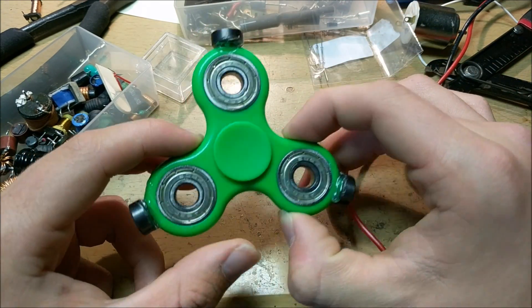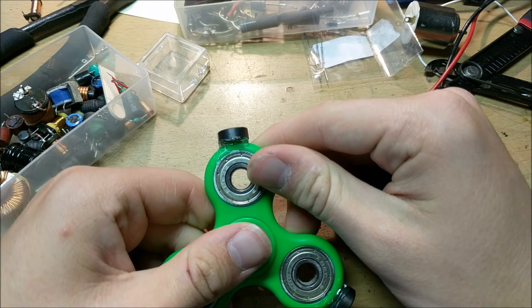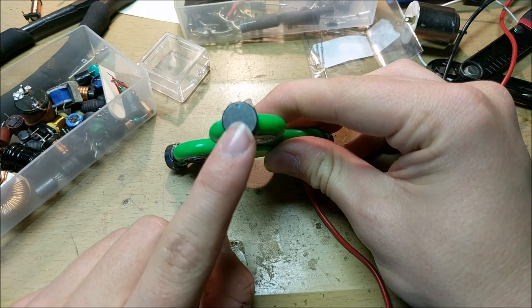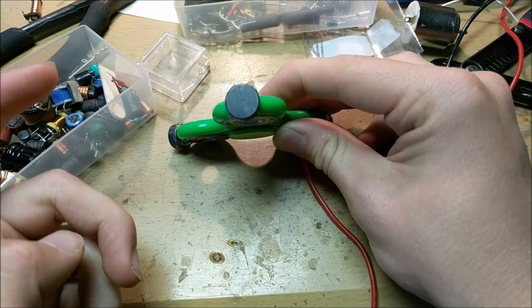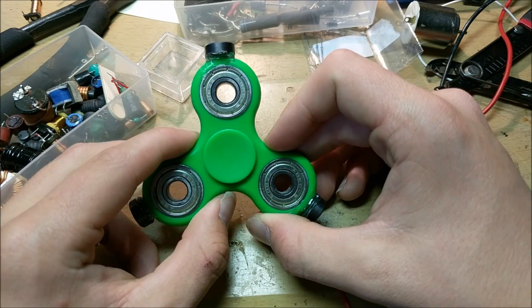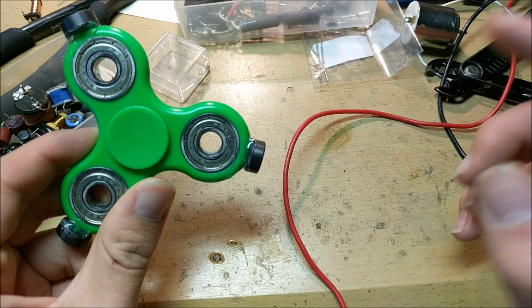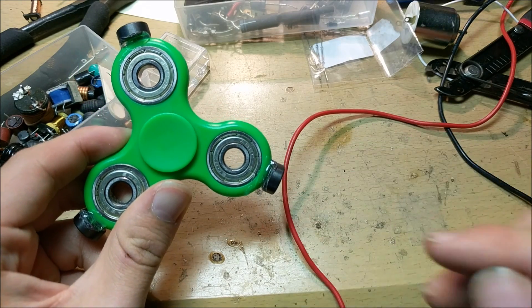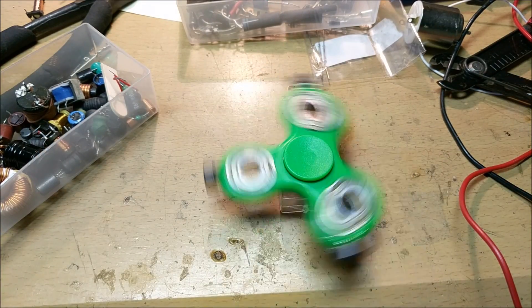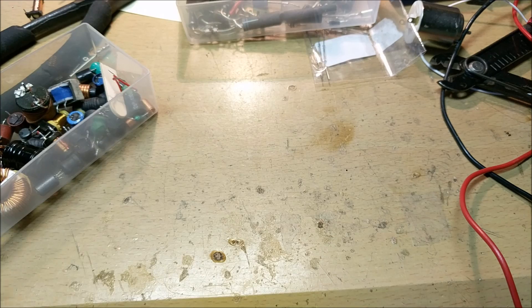What we're going to have to do is modify your spinner — I got this one off eBay for about four dollars, so it's pretty cheap. We need to mount the magnets on, and this part is pretty easy, but you're going to have to have them all facing the same polarity. On this magnet one side has a dot in the middle and one side does not, so make sure every side facing outward has the same polarity, otherwise the motor will not work. You can glue these on in any way you like — I used hot glue, but epoxy may work better. After this, make sure it's still balanced because if it's not balanced it will not work as a motor.